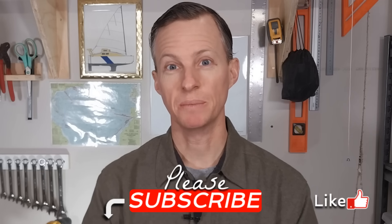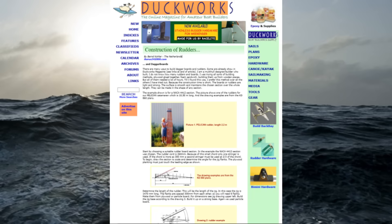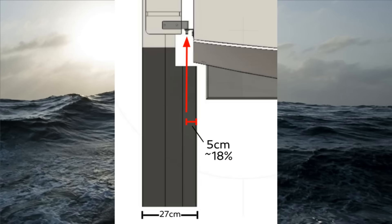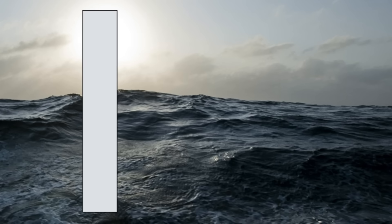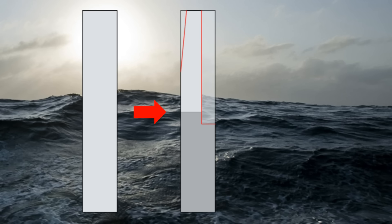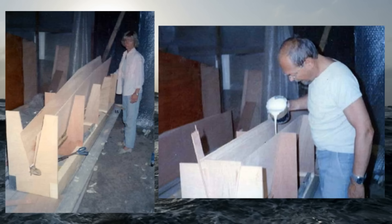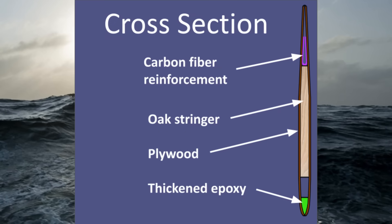If you're new here, please subscribe to follow along on the build and future sailing adventures. The method I'm using for the rudder blades is from the Duckworks article titled 'Construction of Rudders' — I'll link it in the description. I'm adapting it because I want my rudder to be balanced by 18 percent. I'll do this by extending it forward of the axis of the pintles by five centimeters or two inches. This means after I build the rectangular rudder I'll need to cut away a portion of the leading edge. I like this method because you don't need a router, construction time is short, and it leads to a light and very strong rudder blade.